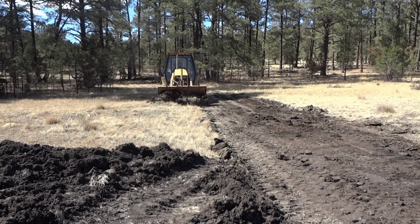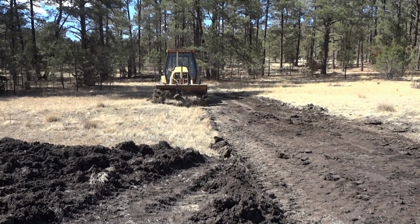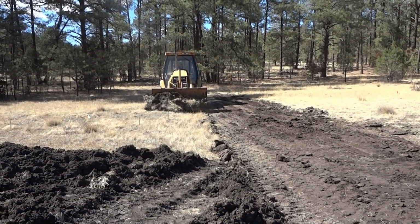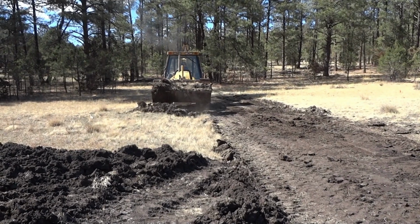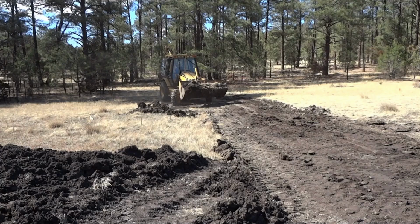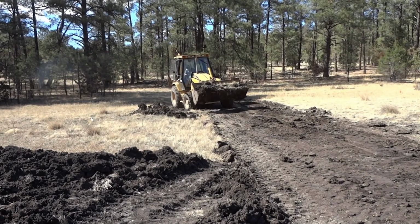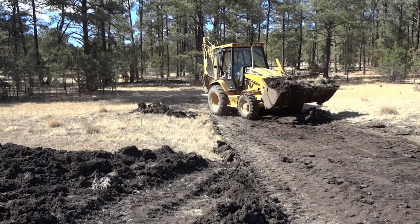It was necessary to remove the topsoil and the plant roots because we would need to harvest about 12 inches of clay from the area around the ponds so we could line the bottom of the ponds with clay. The grasses, roots, and topsoil were placed in piles along the edge of Blue Lake for later placement in and around the finished wetland. We hoped that the topsoil would contain viable cysts of fairy shrimp and tadpole shrimp that had not been seen in Blue Lake for years.